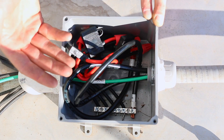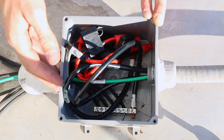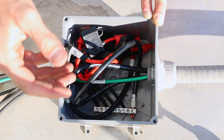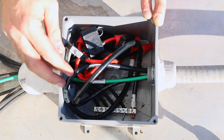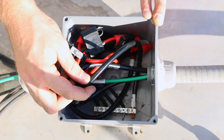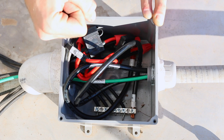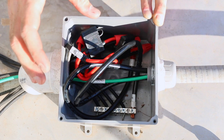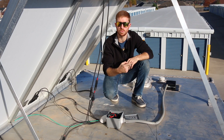The reason these output wires are so much bigger is because they carry all the power from four panels wired in parallel, which quadruples the amperage. Instead of handling about 8–9 amps, they need to handle north of 32 amps. It's always better to oversize your wires so you don't constrict the energy coming from your solar array — getting wire sizing correct is very important.